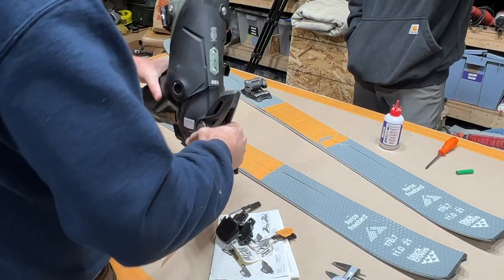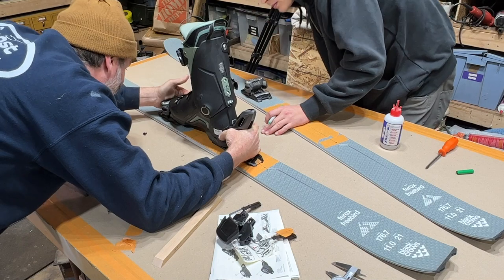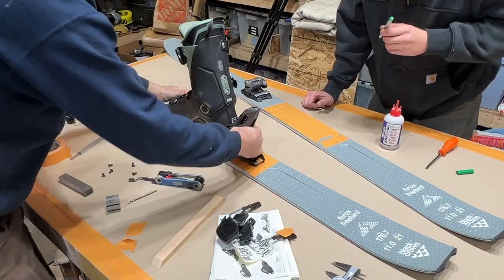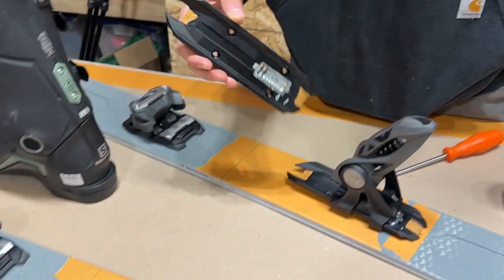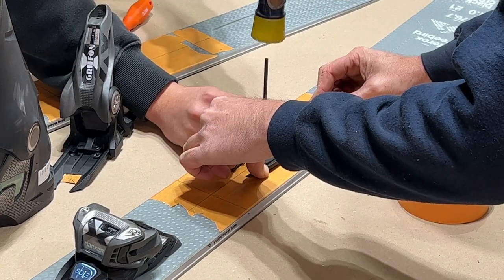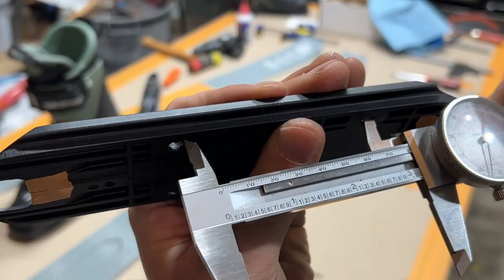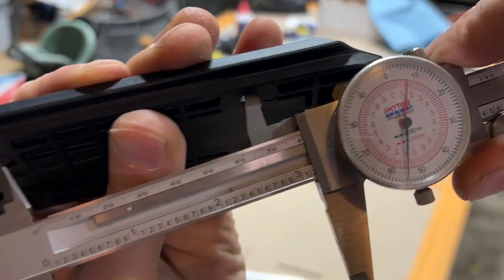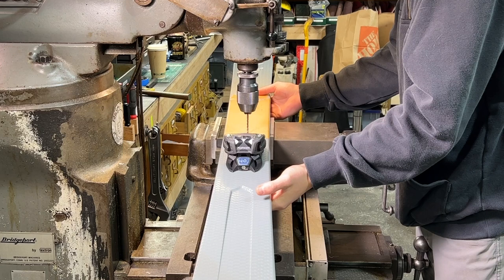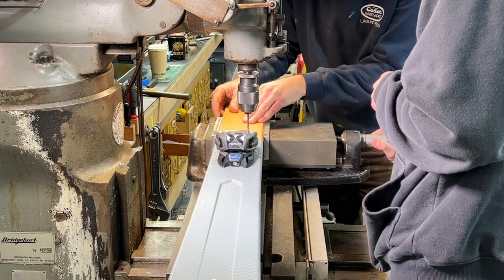With the adjustment set to center of travel, we can hook this onto the heel of the boot, put the toe of the boot into our toe binding, press this down on the ski, and when it's nicely aligned on our lines drawn on the masking tape, Tao puts a mark. We remove the boot, take off the mounting plate, and now mark the holes using a transfer punch — I ground down the tip to be a little flatter, easier to use in those countersunk holes. Getting center to center — edge to edge is the same as center to center. Marking the other ski then moving over to the Bridgeport, clamping it up with cardboard on the edges so as not to damage the ski edges.